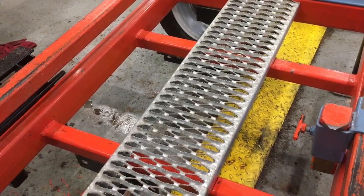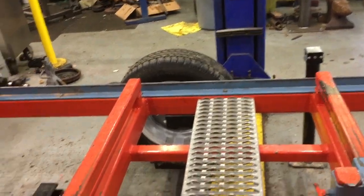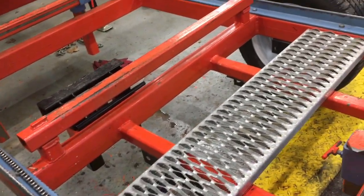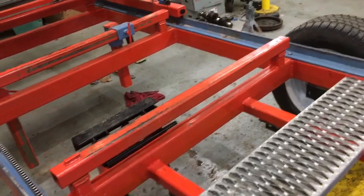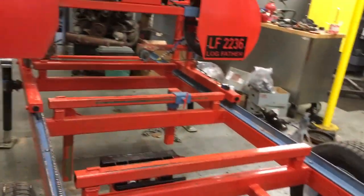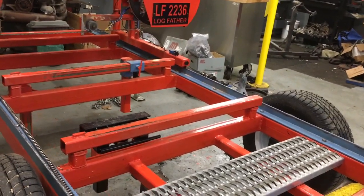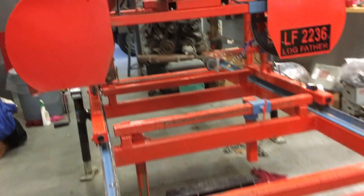But this also allows me to put a stump. Believe it or not, part of my market — I've sold quite a few anvil stumps. So I put the stump here and I can shave the top of that stump off, which gives me a nice place as a platform below the bunks. Then I can turn the stump upside down and cut it off exactly the height they want. The magic number for a stump: the top of your fist should be where the top of the anvil is. You measure from the top of your fist to the ground, then subtract the height of your anvil — that's how big I make the stump. That gives you a perfect blacksmithing, fairly effortless, fatigue-free anvil stump.